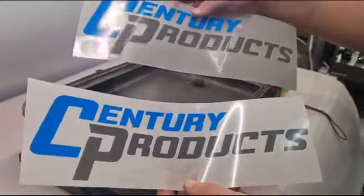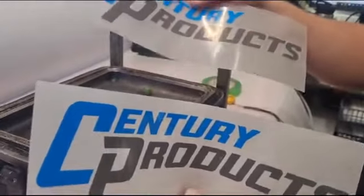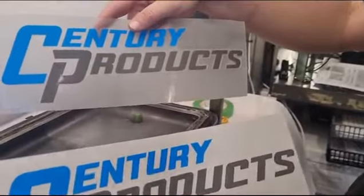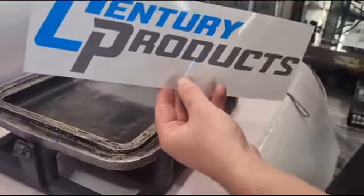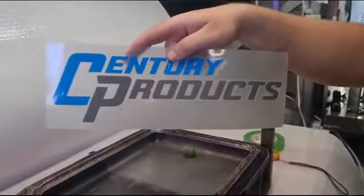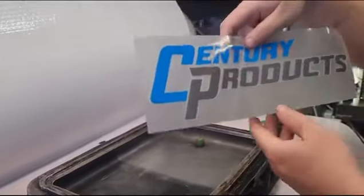Hello Trison, I trust you'll be the one looking at this video. Our deepest apologies for the delay in providing these for you. These are now produced for your Century Products logo — two different graphic types. We've got post mold, so that's applied once the part has been molded, and then this is in mold extreme, so applied onto the mold and then it's molded into the part.